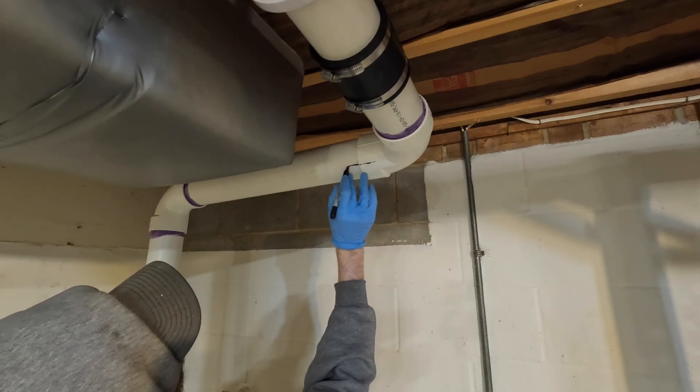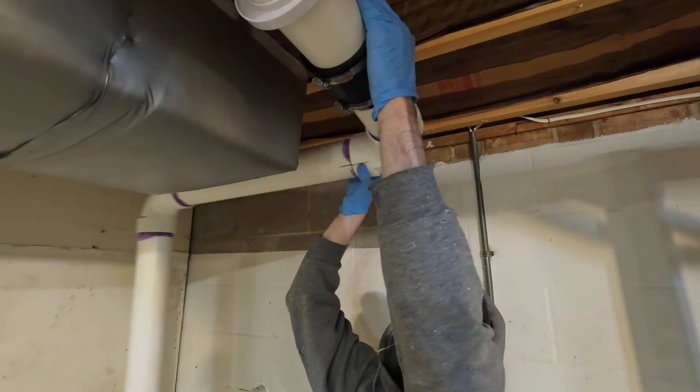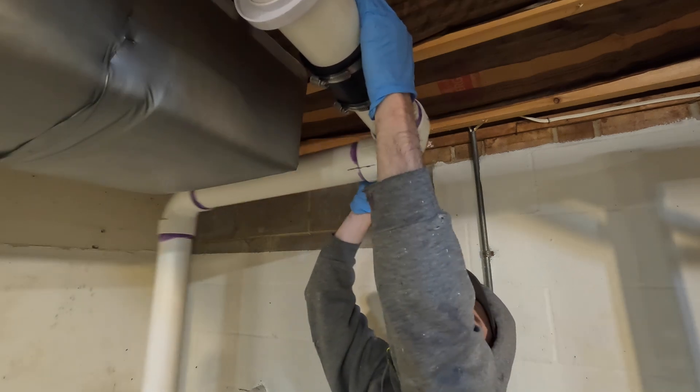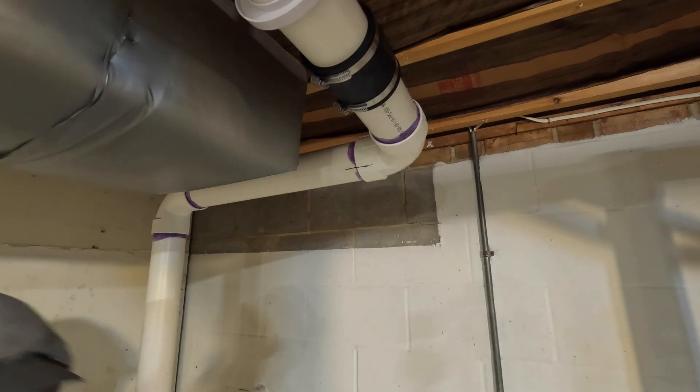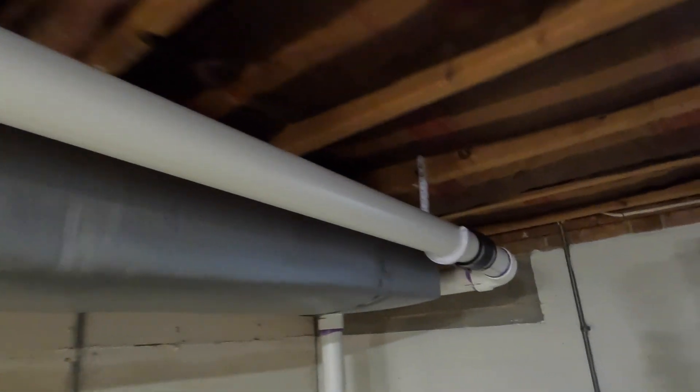Next, I just had to connect the flange on the sump cover to the pipes in the wall. One thing I did was dry fit the angles and marked them with a sharpie, then glued them out of position where it's easier to work and matched the marks up to get the correct angle. Make sure the marks are long because the PVC primer has acetone in it and it will remove the marker.